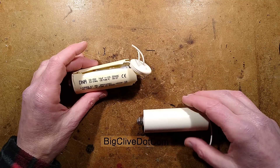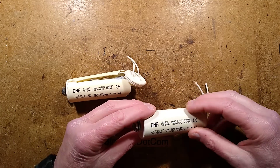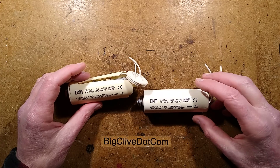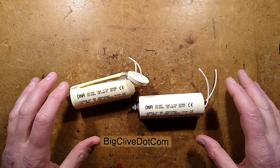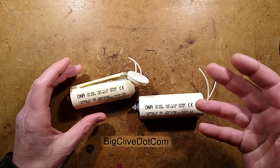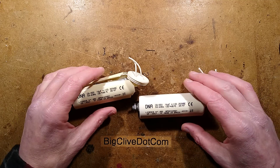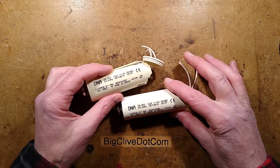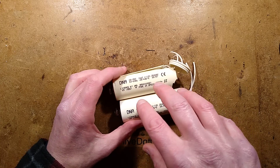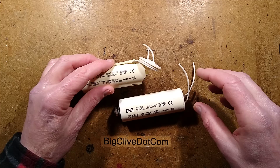The mess is cleaned up, let's continue. For reference, these capacitors were in parallel with the incoming supply to the light. The inrush current to a row of streetlights or floodlights in a building is just terrible - it tends to damage contactors, it really pits the contacts over time. Initially when you power it up, it's basically a 32 microfarad capacitor across a 240 volt supply times the number of light fittings you have. It used to be quite problematic.